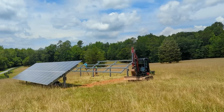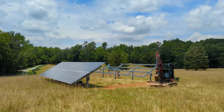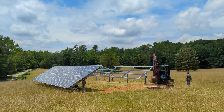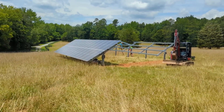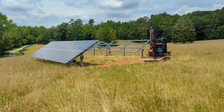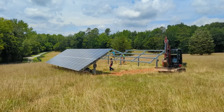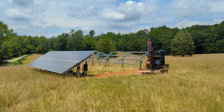Solar up, solar down, inverters, batteries — it is fairly scalable. It would have been easier to do it all at once, but it's not the end of the world to have to come back and add an array. You kind of know based on the load profile of a site that they really want more power, so we make provision for oversized conduits, oversized wiring troughs, and make room for more batteries — and that's what we're doing.